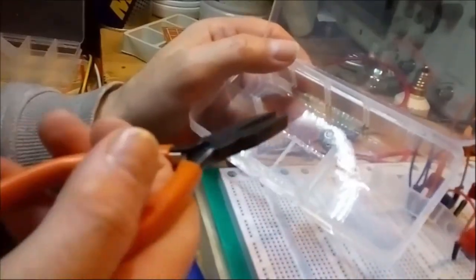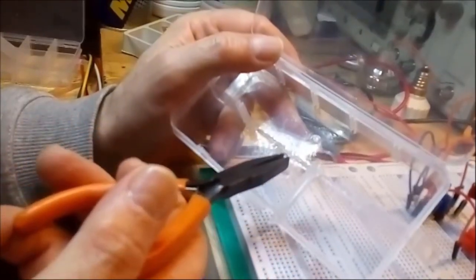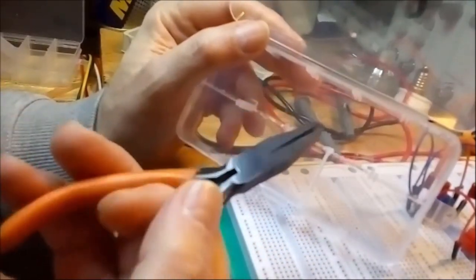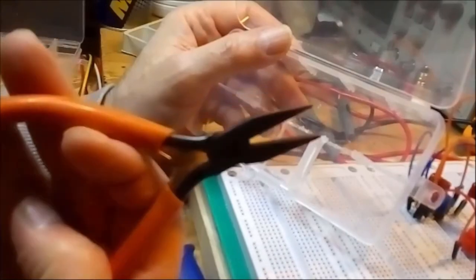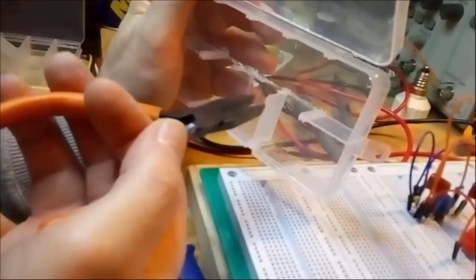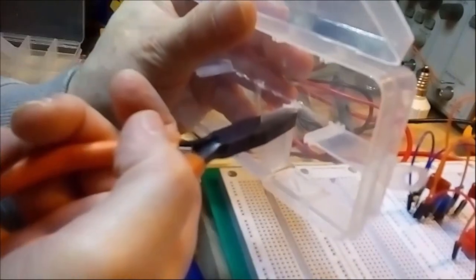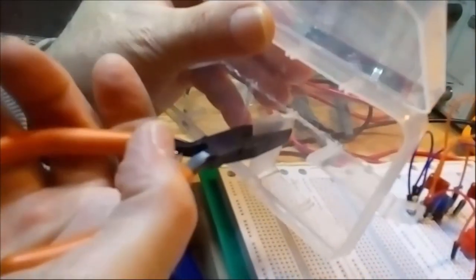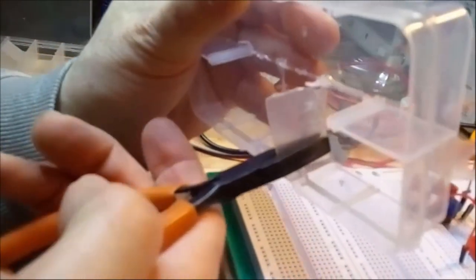Okay, once you cut out, let's say, part of the dividers, it's only a trick of using pliers like these. These are just plain duckbill pliers, and you grab one of the dividers like this, okay, and you just twist it a bit like that. You move it on half an inch, twist, move on, twist, move on, twist, and as you do, you slowly tear the plastic away from the bottom. There you go,